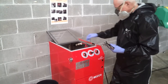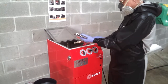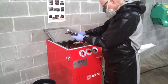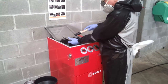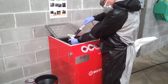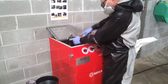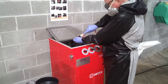Attach the quick disconnect to the spray gun to protect the air passageway. Turn the power clean switch to the on position to activate the compressed air. Clean the fluid tip and fluid entry passageway aggressively with the flow brush. Clean the air cap with the flow brush, making sure to clean the small holes in each air horn.